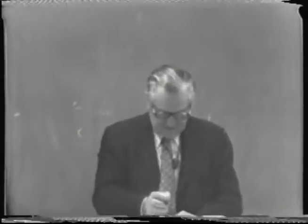Now this is heated with steam, and this is called a continuous whiskey doubler, so all the distillate coming from the main beer still condensers goes into the doubler. It's heated with a closed coil, and part of it is vaporized and condensed in the whiskey condenser above it. And of course then flows out from the condenser to the receiving tanks. Now the liquid in the bottom of that doubler, which is the residual liquid from the vapor passing off as the whiskey distillate, is drawn out and pumped back into the upper part of the beer still continuously.